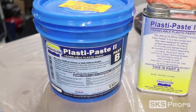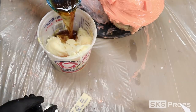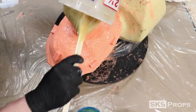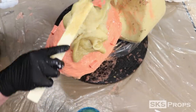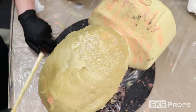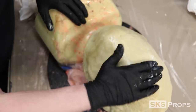For this particular mother mold, I'm going to be using Plasti Paste 2. It is a 2-to-1 mix ratio and it cures to a very hard material. After parts A and B have been mixed together, it's as simple as dumping it out onto the jacket mold and forming it using a paint stir stick. You do have a limited time to work with this — you can tell the material will start getting hot and it will be harder to move around. I dip my hand into a little bit of water, which will help me smooth out the surface.